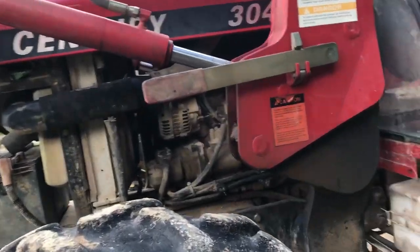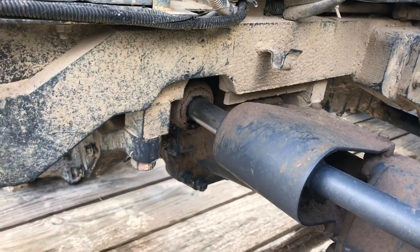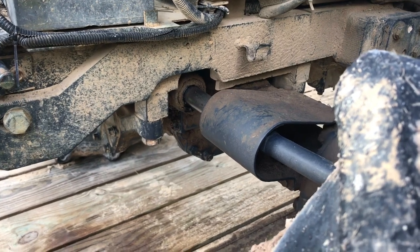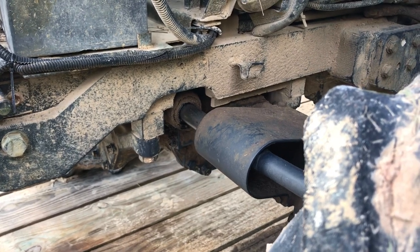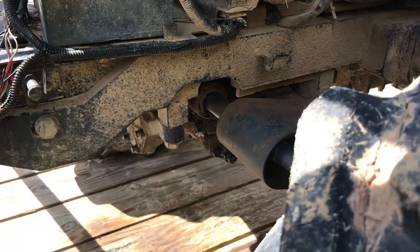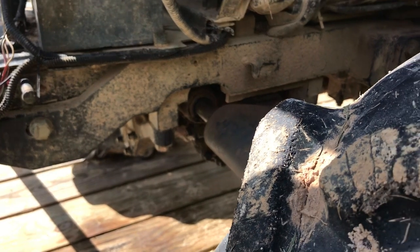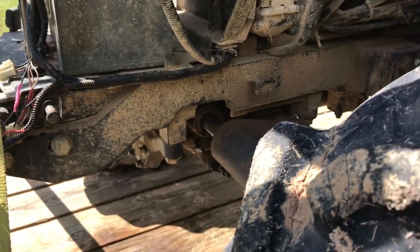It's as if the wheels are controlling the steering wheel versus the other way around like it's supposed to be. When the engine's revved up and gets warm it starts working. This front steering cylinder is seeping — I think that cylinder is maybe washed out inside. I'm not 100% sure how that cylinder works, but I think it's messed up internally so that when I'm turning the wheel it's basically fighting itself. I think the pump is fine, I think all the hoses are fine — it's something in that steering cylinder. As the steering fluid warms up and gets hot from running, I think those bad seals maybe swell a little and start doing what they're supposed to again. After running it for a while and really turning a lot and getting that fluid warmed up, the steering gets seamless again — but when it is cold, it is nothing shy of a fight.